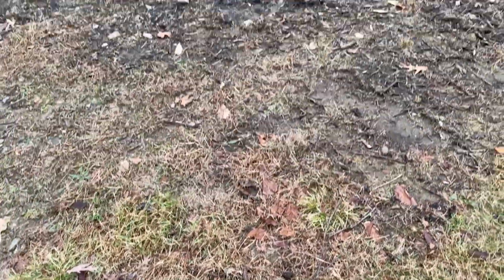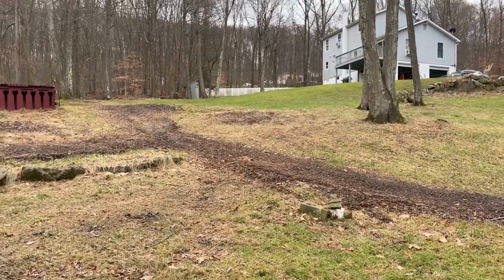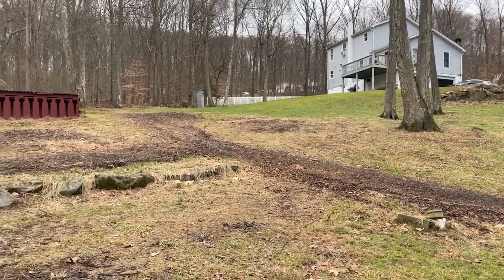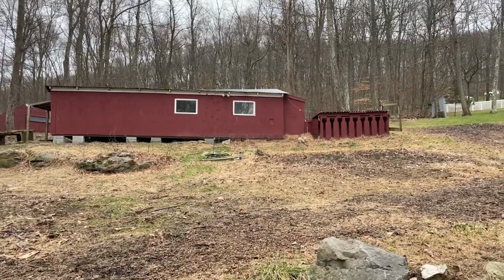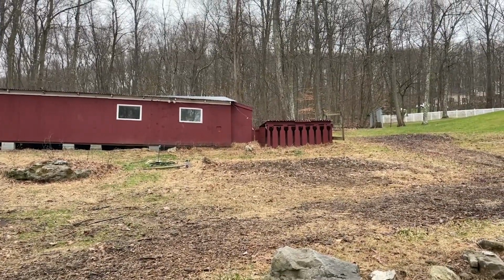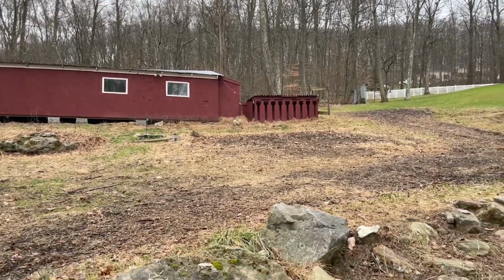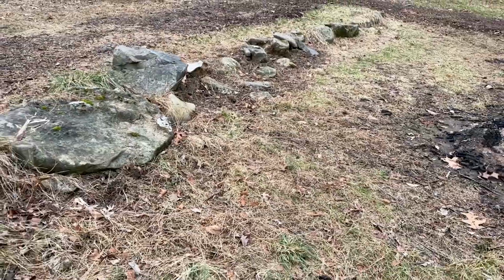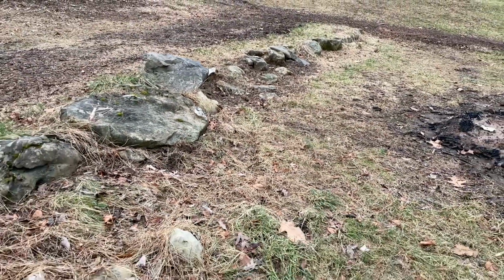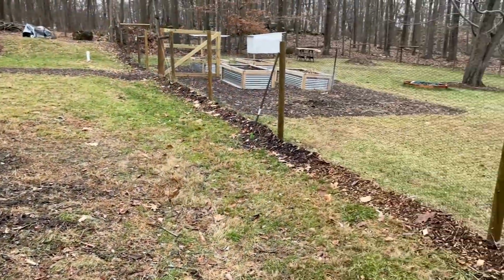Okay, well, that's frozen, but that's just like an access point. And the access points were over there, and I don't know if they got buried. Pull the electrical line from there. Because there's actually a breaker box in there. Pull the electrical line, pull the water line, but that means I need to get through this rock. I need to dig 4 feet down to get past the frost line, and then that's a big area.